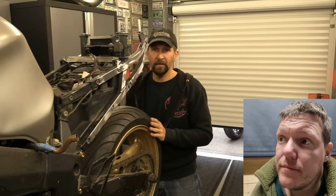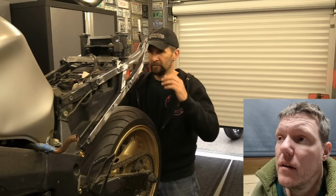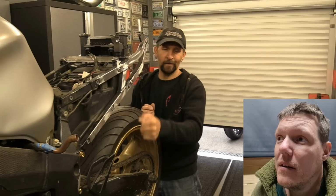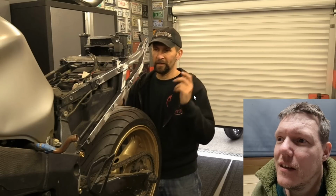And all these things, like all sheet metal fabrication, start with cardboard templates. So I'm going to get some cardboard and start making a mock-up. Scissors and snipping is far easier than angle grinders and one-off cuts. At least with the cardboard, if it's not right, you can chuck it away and do it again. So it's measure twice, cut once.